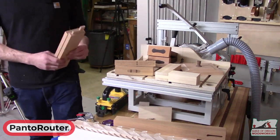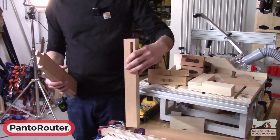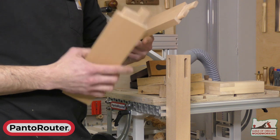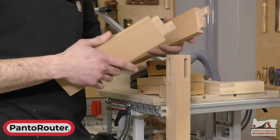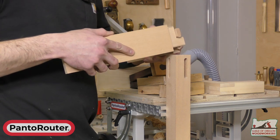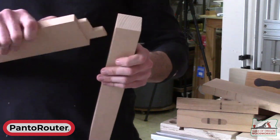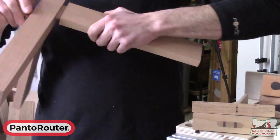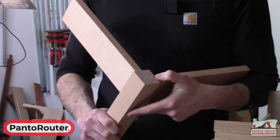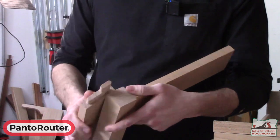One other quick joint we'll show you here is intersecting mortise and tenon. This is really common in chairs where you have a leg and two rails or aprons, and you want to maximize the strength of your mortise and tenon by making it as large as possible and utilizing as much surface area as you can. But often you don't have a ton of room in your leg to accommodate two long tenons. So we've created tenons that are stepped and go in like so, and once glued that's an incredibly strong joint — it's going to last a long time.